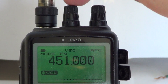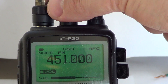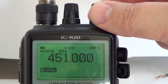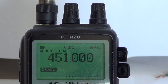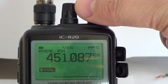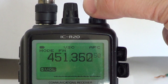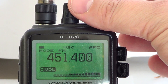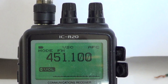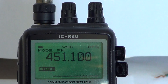Keep in mind how to adjust the volume level: on the upper left, the two buttons on the left side control volume. On the right side is the VFO frequency dial — these radios have a tuning control you turn to change the frequency. The upper right button is that dial, so turning it changes the frequency you're listening to, just like a tuning dial. Clockwise goes up in frequency, counterclockwise goes down.